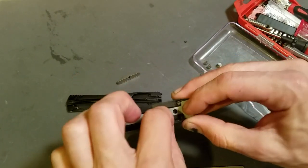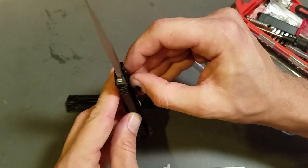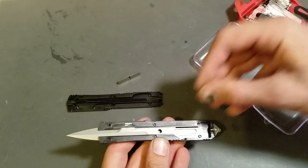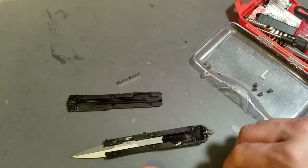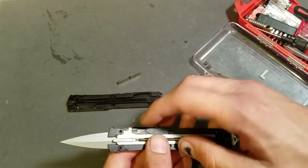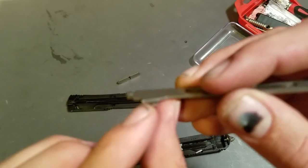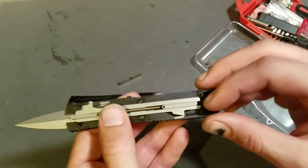You see it didn't quite make it past that second lock there. I'm still going to reassemble it because it did pretty good. It did make it all the way in. So that passes and I'm going to reassemble it. Get it up into the unlock position here. The other side here is that this top lock is actually disengaged by this ramp — you can see that cutout section there. And this little tab protruding is actually what rides into the button itself, the switch itself. You can see that it's disengaging it there and it disengages it when I pull it back here.